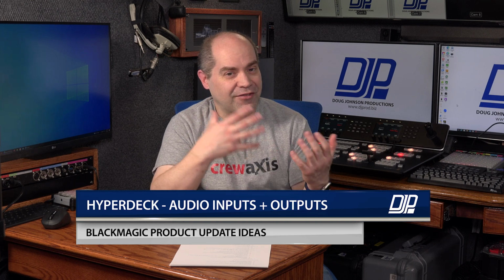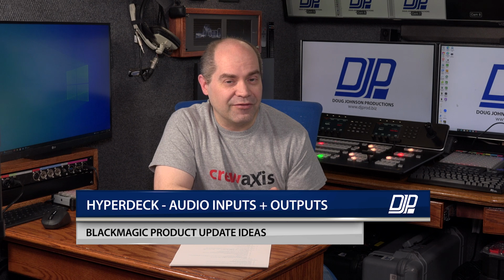Just to give you an example, very often when I'm doing video production, I have pre-recorded video segments that I need to play back as part of the presentation. I use HyperDecks to do that, but getting audio from the HyperDeck over into my audio mixer has been a pain. So what I've actually done is I've taken an old SDI to HDMI mini converter, which has audio outputs on it. I've got that hooked into the monitor output on one of my HyperDecks, so that I actually have a way to get audio out of it, because otherwise there is no way to do that.